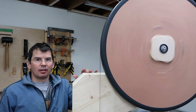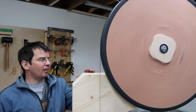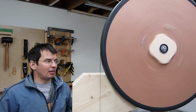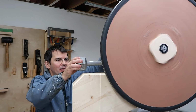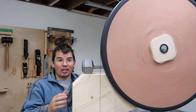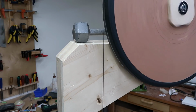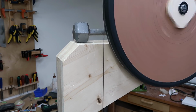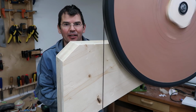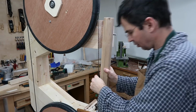So I think that's shaking less than it used to be, but I'm kind of close to the saw's resonant frequency, so if I lower the saw's frequency by putting this weight on it, the shaking gets worse. And now with 2 weights, see the shaking? And less shaking. So this shaking is a funny sort of thing. With my 14-inch bandsaw, I actually found if I put it on a really wobbly stand, it shook less.